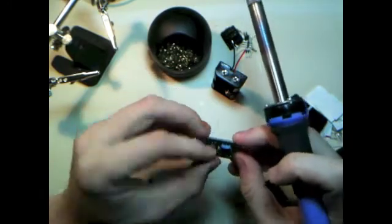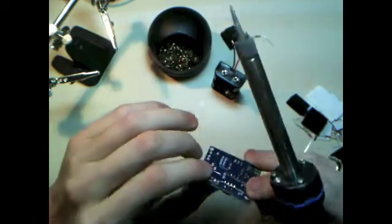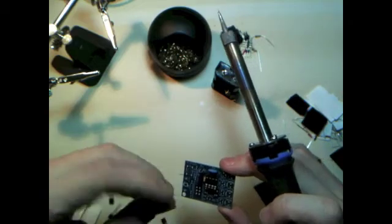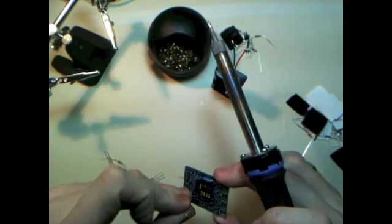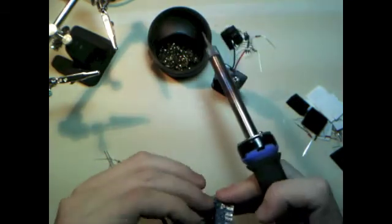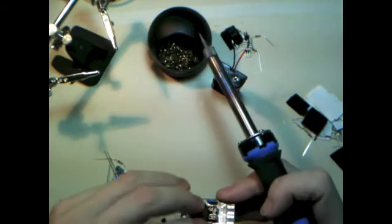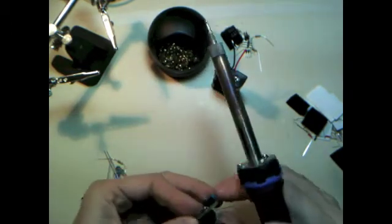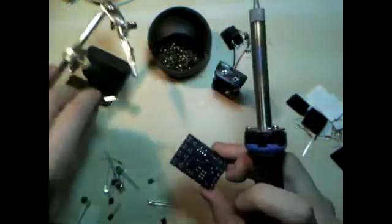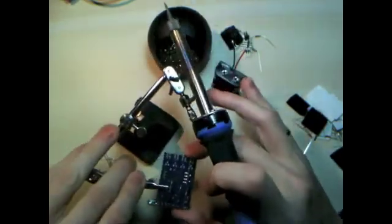This capacitor, I'm going to bend over sideways so it doesn't stick up too much. You see the long leg went into the hole that had the little plus sign next to it on the board. I always enjoy putting in resistors — I don't know what it is. If you bend them into a sort of a C shape before you put them down, they just slot right in. Then you fold those legs back. I've put several pieces all going in the same direction, which makes it really easy to do them all soldered up at once.